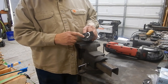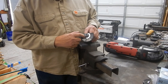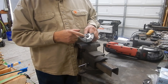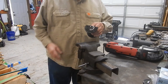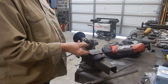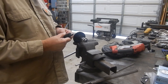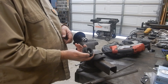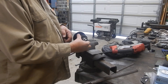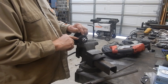Still have full engagement. You'll look at this and say I'm cutting off the whole landing, but not really on this side — the end of this spool actually lands inside here, so losing this outside ring does not hurt at all. This is an inch and a quarter sprocket with two set screws — I'll change those out to extended-point set screws. On the other spool with the exact same maker of winch, I had to use a flapper wheel to clean out the inside of the sprocket, but this one slips right on easy. We'll still drill and put those set screws into the spool.